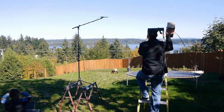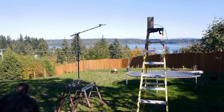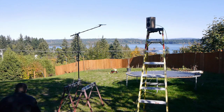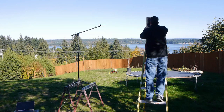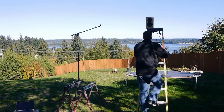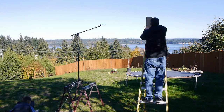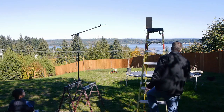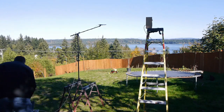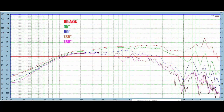To show this with measurements, I took the speaker outside to get detailed data as low in frequency as possible. Getting measurements down to the box roll-off — around 150 to 120 Hz — is not possible indoors unless you have extremely high ceilings. So I set up with the microphone a meter away, took a measurement forward-facing, then rotated the speaker 180 degrees. With that data we can see the difference in what sound is projected forward versus all the way around the speaker.